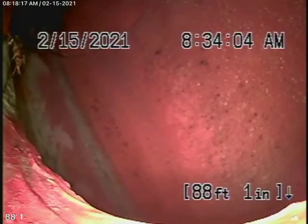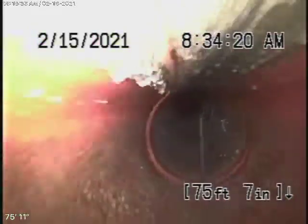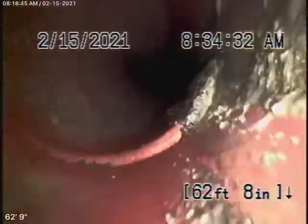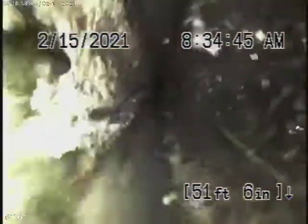You can see the city sewer flowing by over there. As we pull our camera back, we have a six-inch clay lateral coming back from the middle of the street towards the property, and it actually appears to be in pretty good condition — nice and clean. It comes onto the property and it's going to change to a four-inch clay pipe as it comes up and then comes horizontally. It's nice and clean, and the line is going to be in pretty decent condition.